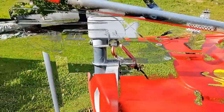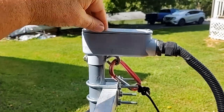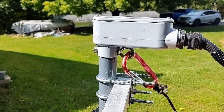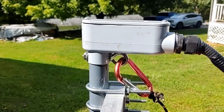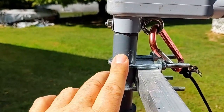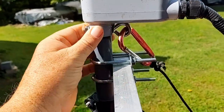To wire it up here in the back I used a 3/4 inch LB electrical conduit. If you use white, white is not made sun-resistant or UV-resistant so it will deteriorate over time. But if you use electrical conduit, it's made to withstand the sunlight. I attached it here — you'll have to grind out the LB a little bit and sand the shaft of your trolling motor shaft down a little bit to get that to fit on.